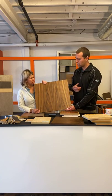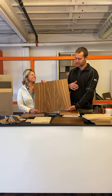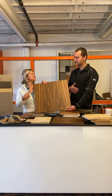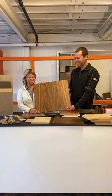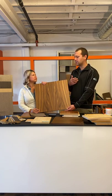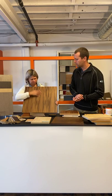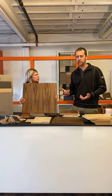There are different grades to how the veneer is done, because not every piece of veneer is peeled and looks perfect. Wood is a natural product and it's got natural beauty to it — it has knots and different variations. Typically the face grade is designated by a letter: A, B, C, D, or E, with A being the highest end and E being the lowest. The back is generally designated by a number: one, two, three, or four. This is a number one back for walnut — you can see it's a little more wild grain, not quite as consistent in color.